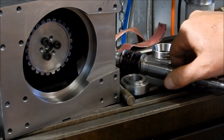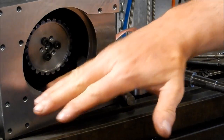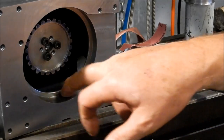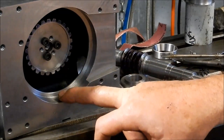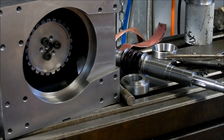Bit of a pain, I guess, when you're buying this sort of gear off eBay, cheap and nasty, the numbers may not quite be right. And you know, I reckon if I had to drop the centre down maybe a couple of thou, we would have been right. But anyway, can only go with what we calc up. So anyway, we'll go ahead and we'll get that set up.